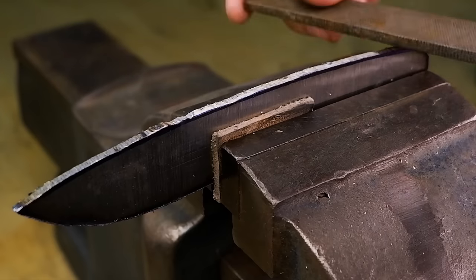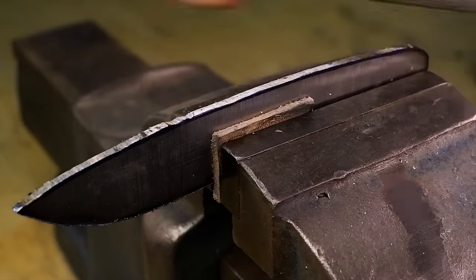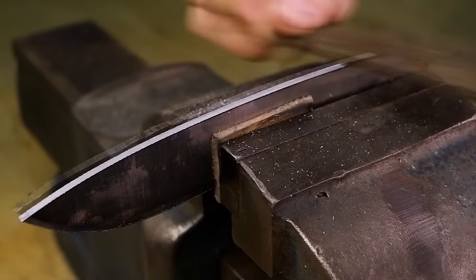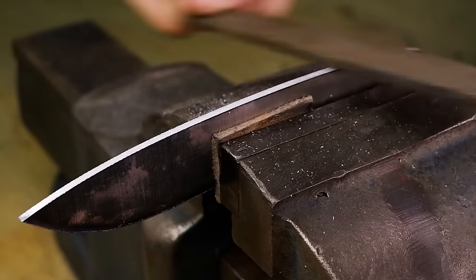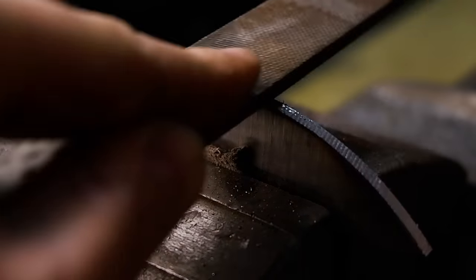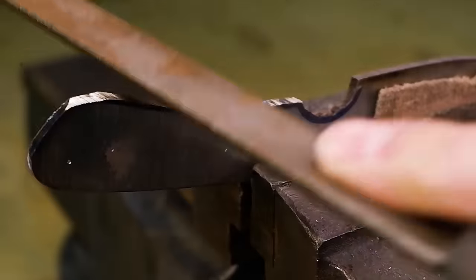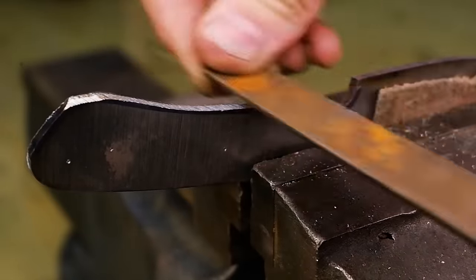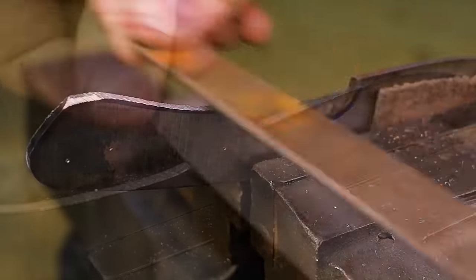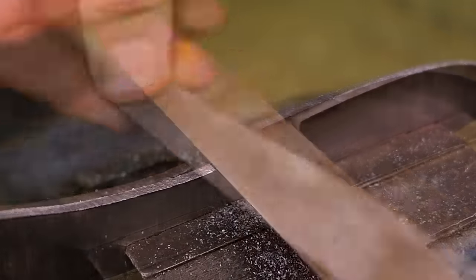Let's get started. I'm using 3.5mm 1070 steel for this build. Mark your template onto the steel and cut it out using a disc grinder or a hacksaw. I will include a link to download the template in the description. For my disc grinder, I prefer the thinner cutting blades for cutting and then a grinding disc to remove as much excess material as possible to ease up the hand filing process.